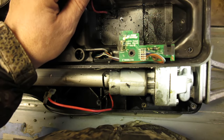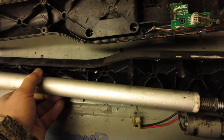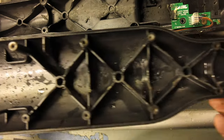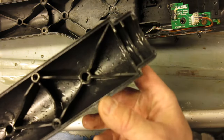In this arm, that defines the closed position limit. The open position limit is defined by just that little limit switch — when the arm comes back, it hits that little switch. But the closed position, if you're using push-to-close, is defined by that encoder. You can see a lot of water in this housing and that's never good for the electronics.